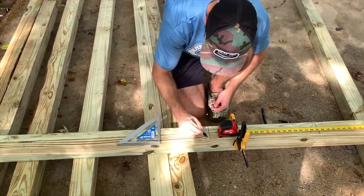As we lift it, you'll see that the guides are going to pivot along the pivot point, which is where the left hand and right hand jamb intersect with the guide. We made this look a lot more awkward than it needed to, but essentially you and your helper are going to walk the door up into place until the guides contact the left hand and right hand jamb. What I'm showing here is a section view of how it would look as you lift the guide into place and as it contacts the jamb.